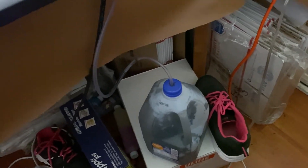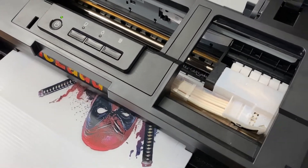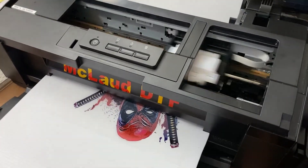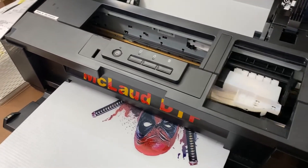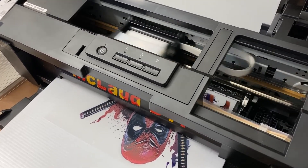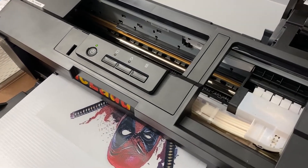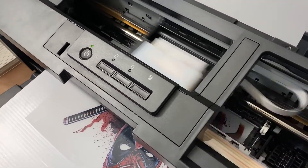We have a lot of backup for that. This is one of the innovations that the Mac cloud printers did. This printer is a new printer — we have two models right now for Epson L1800; I'll explain it in the next video. My lesson that I'm trying to share every day: before you start any printing, shake it, do the head cleaning or nozzle check to verify that your nozzle is all correct so you can align it, so your printer is precise and you don't miss any color or white.